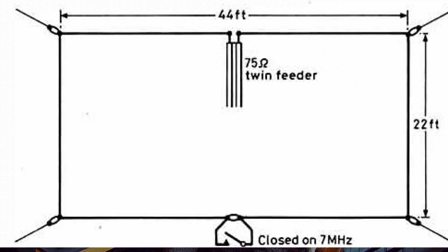If we put a switch in the bottom of this antenna and open that switch, the antenna then becomes a half wave — it's sort of like a bent half wave — and it's resonant on the 80 meter band. So open the switch to break the loop and we have an 80 meter dipole, sort of bent around the garden. We know bent antennas work pretty well anyway. It is low for 80 meters and you'll get high angle radiation.